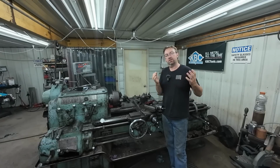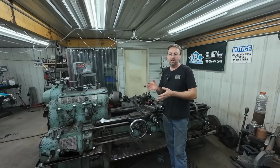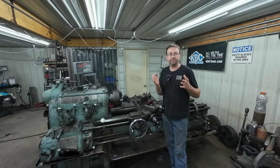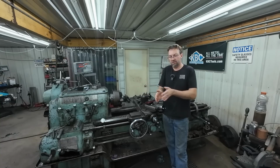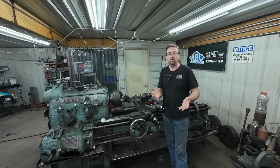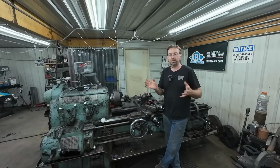But first, just adjusting your feeds and speeds made a huge difference in the whole process. That went from about 20 minutes of milling to, when I changed my speeds and feeds, down to 5 minutes to do both ends. About 2 minutes to cut that in, a minute to move over and reset. So about 5 minutes in total. The whole job, the whole part, sawing it, drilling it, facing it, everything, and material moving, maybe 15 minutes apiece.